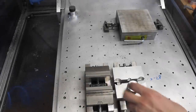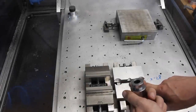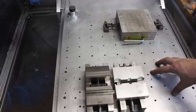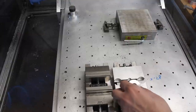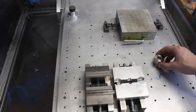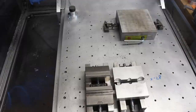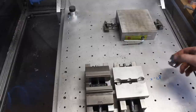Let's look at our options here. We have devices on the mill. We could machine soft jaws for this part, but I hate cutting soft jaws for one part. Another option would be a 3-jaw or 6-jaw chuck that we clamp to the table of the mill. Very good option, but I have to go into the other room to get the chuck. A very good option would be just to bolt it to the table with one central screw. Again, I would have to go to the other room to get a bolt. We could strap clamp it down. Nah, we don't do that. That's too much work.